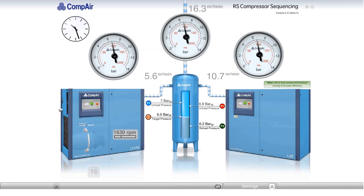As long as the system demand stays within this window, between 10.8 and 24.3 m³ per minute, both compressors will run. At lunchtime, production slows and demand drops to 6 m³ per minute. The fixed-speed machine continues to produce its fixed 10.7 m³ per minute, so the pressure rises.